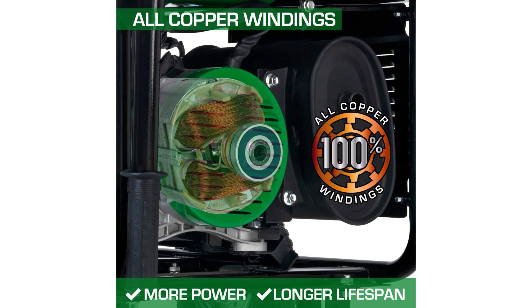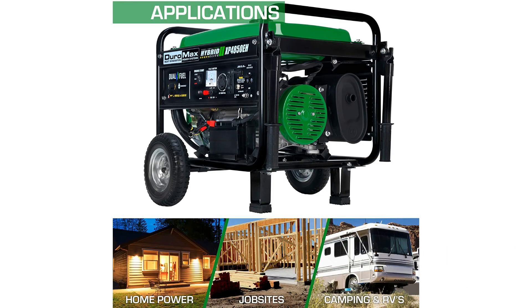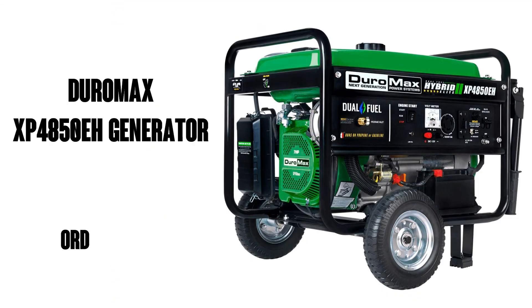I've run my house on it — 240 volts to inlet. Not enough kick for the washer, dryer, and AC though, so leave those fuses off. It runs the rest of my house just as good as my energy company. Also, for people whose generator broke: don't start a generator with a load on it — it will fry. Let it warm up, then plug in loads. I'm betting that's what happened.